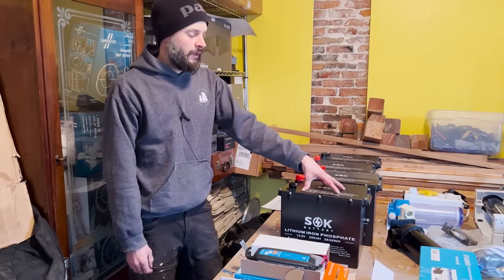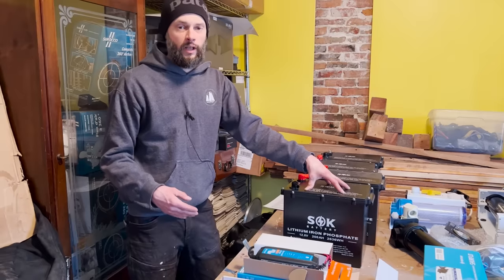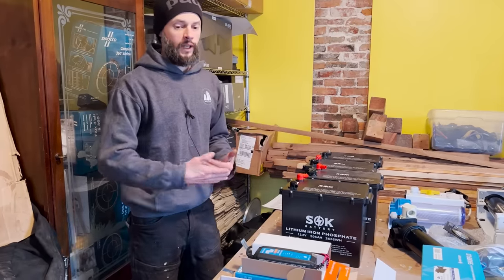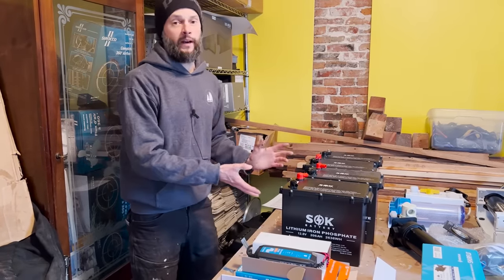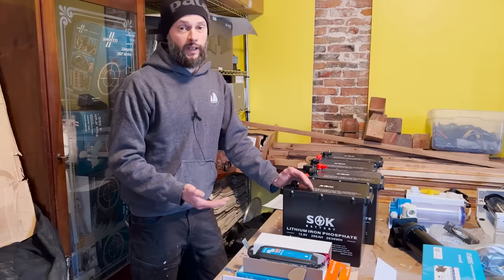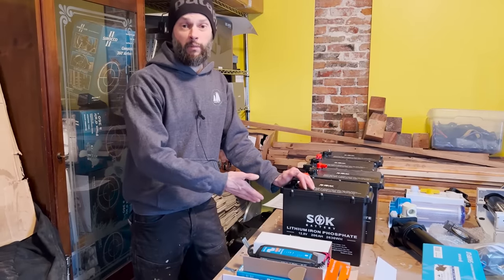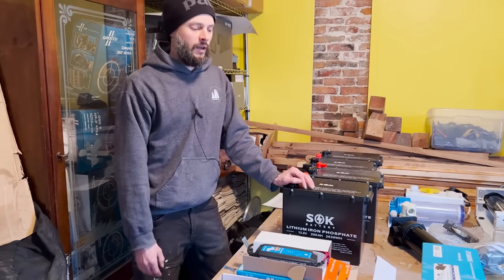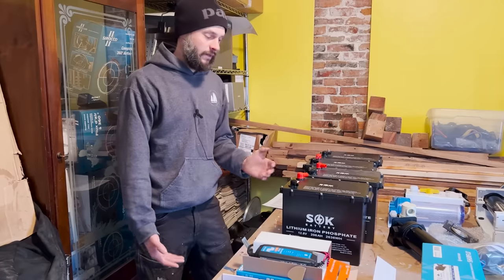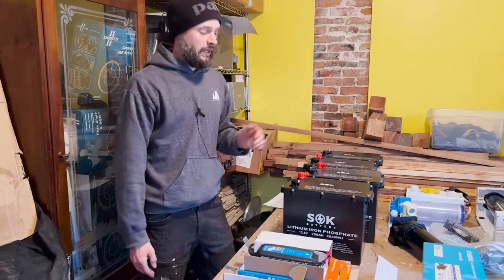And by having a bigger battery bank, we'll be able to go longer durations without charging. So if we're going to motor from point A to B and be motoring all day, we'll be able to charge up this full battery bank and then be able to take, my guess would be, a week or two to drain the battery bank without any power having to go in. So if we have cloudy days, or if we're motoring a lot or we have a ton of sun, the big battery bank will give us a wider range.